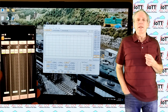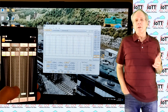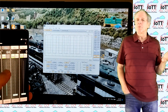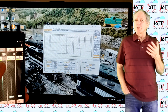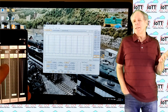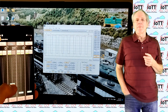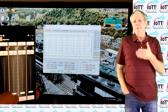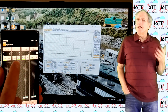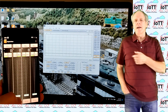For the motor, this kind of looks like a changing voltage, and the longer the pulse, the faster it rotates. When I change the travel direction at speed zero, both track signals go to the opposite polarity, but since both are the same, the motor sees no voltage. When I increase the speed, I see the pulses appear again, but this time in the other direction. This change in polarity makes the loco move in the other direction as well, and the LED on the power shield changes from red to green or vice versa.